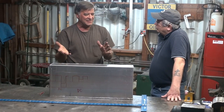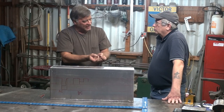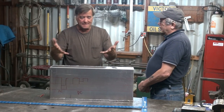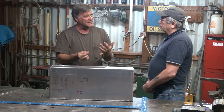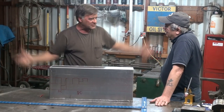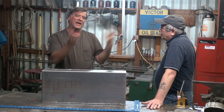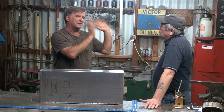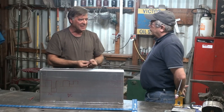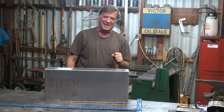This is just some 16 gauge — that's not very thin. We can go up to 20, 22, or 24 gauge. With this machine, you could actually get two soda cans and weld those together. Real world applications: anything thin. All your food industry, all that thin stainless they use making big commercial kitchens. In hospitals too, a lot of pulse going on there. Welding has gotten as scientific as everything else. You can get into aerospace, the aircraft or space industry where they're trying to save weight — your race cars, the car industry — things are getting thinner. That's where pulse is coming in. I just thank you very much. Thanks for coming. So I'm going to go back to work on this — I'll see you guys next time.